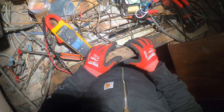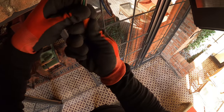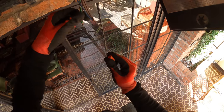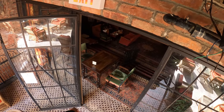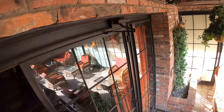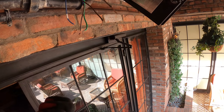What I'm going to do is process of elimination — I'm going to disconnect one of the units, run it, and see if it trips or not. So here's our low voltage coming in; we have three wires on each. I'm going to disconnect one of the heaters. Alright, so I just disconnected this heater — they said this one was working last. Let's flip the switch and see if we have our 24 volts. That thing tripped. I disconnected everything, all the wires coming in, and I reset it and it tripped again.